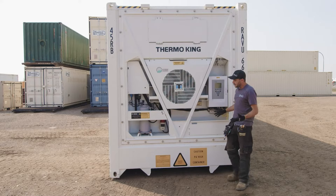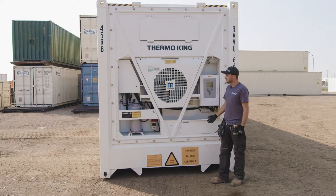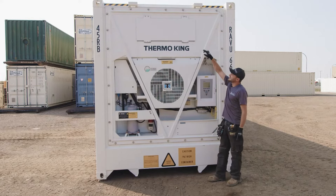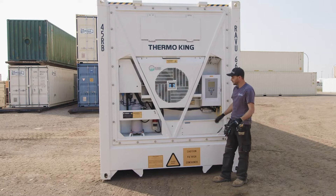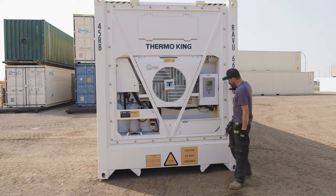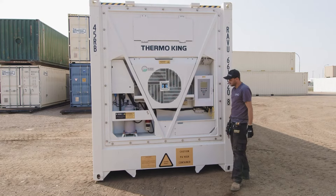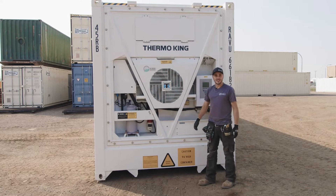If you're buying one of these as a container home, the reefer unit is really unnecessary and oftentimes people unbolt them. All the stainless steel bolts are here and they're very easy to remove, then there are lift lugs and fork pockets so you can take your forklift and carry the unit away. If someone wanted to build a patio door or glass on the end wall, you'd probably want to keep some of the structure though - it provides the moment frame and stops the container from twisting, but you could cut into it with reinforcement.